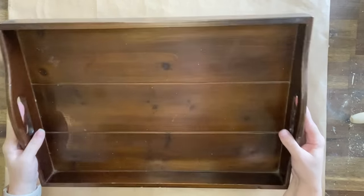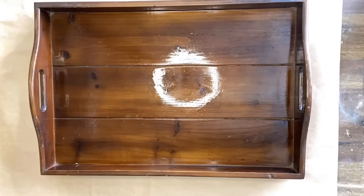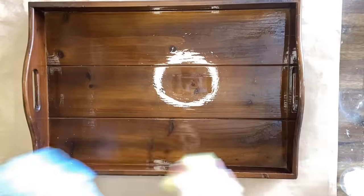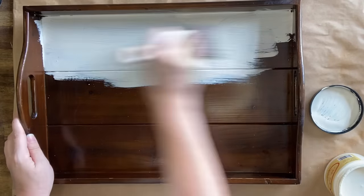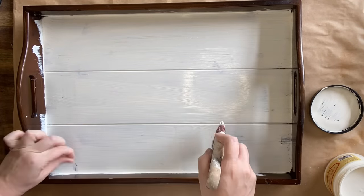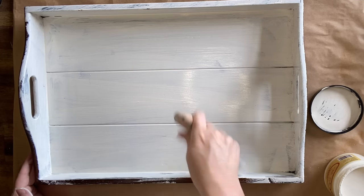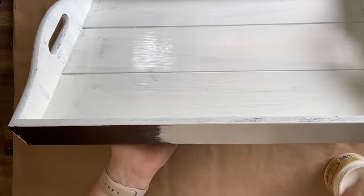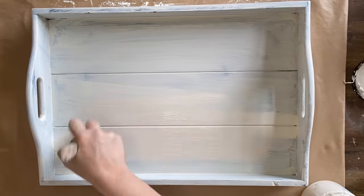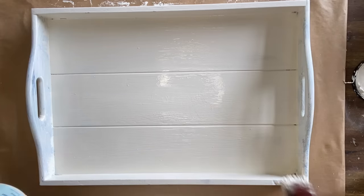I found this wooden tray at the thrift store for $5 and thought it would be perfect for a paint inlay project. But first I needed to clean it well with Dixie Belle's White Lightning — it's a deglosser and a degreaser — then rinse off the cleaner before we begin. I started to paint this tray with Dixie Belle's Buttercream Chalk Mineral Paint, but as I was going along I noticed that I had some bleed through. So I decided I had to switch colors. I'm going for a French country look here, so I wanted to stick close to this color, and Dixie Belle's Endless Shore Silk Mineral Paint is pretty close to Buttercream. So I finished off the first coat to have an even base layer, then grabbed my Dixie Belle Silk Mineral Paint — it has a built-in sealer and a built-in stain blocker, so it's going to make sure that those tannins do not come through. I ended up doing three coats of this because it was a very dark tray.